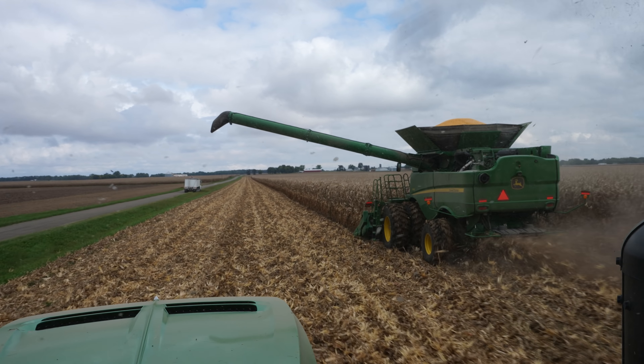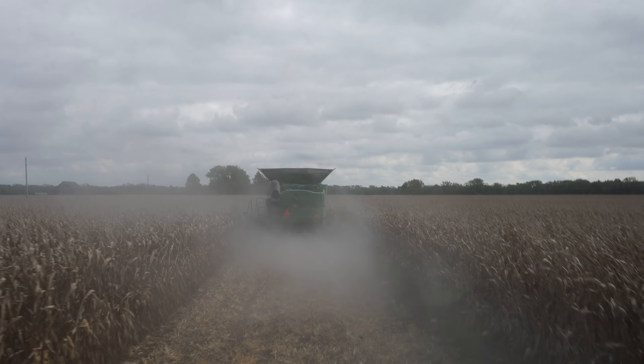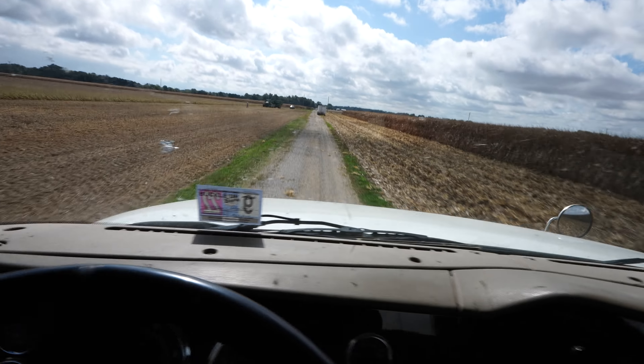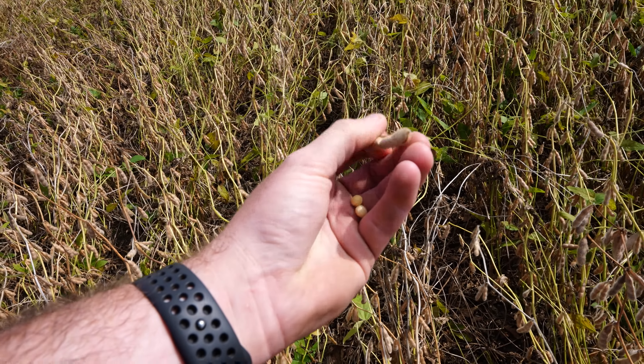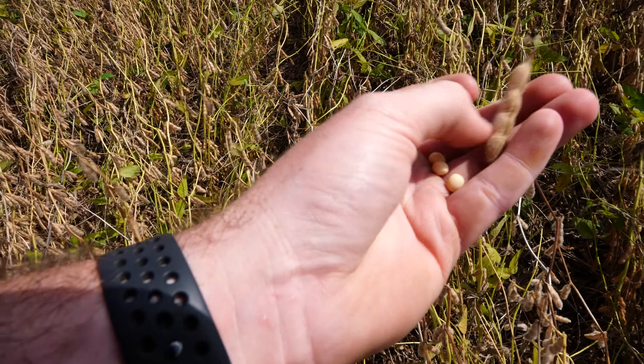Yield's showing 240-ish. The inefficiencies of opening up a field — but corn seems to be doing well. Bringing the third truck to the field; there's no way we're going to keep up even hauling a mile to the road. We're picking right next to these 39 Pioneer beans that were very green but dry — pods are tough. If we gave it a day or two, sun stayed out, temperature stayed warm, and we had a little breeze, they may cut. It takes very little moisture to make it difficult to cut soybeans.